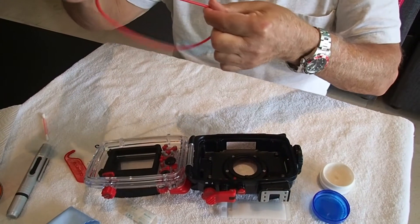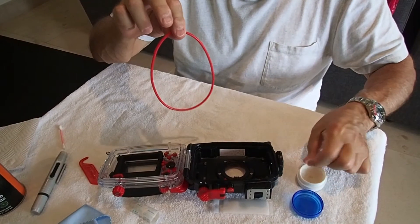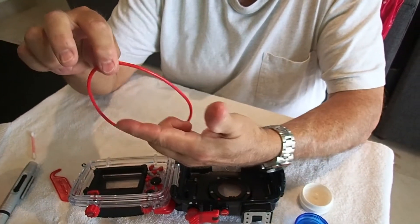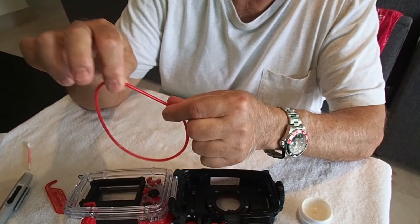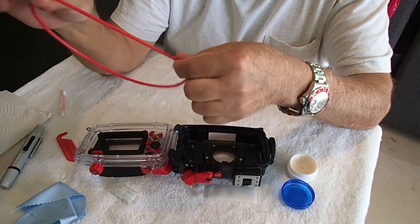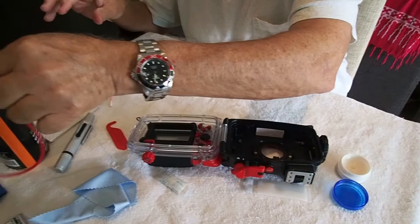Now I'm feeling the O-ring. This one isn't very smooth to begin with — I've had them where they're a lot smoother. Put a little bit of O-ring grease on my finger — never use too much. I make sure that the crease in my finger has got plenty in it, and I run it through there with my thumb. I just felt something rough, so I'm going to put a little more grease on my finger because I wiped it off on a paper towel. Sometimes I take my O-ring and hang it on that.